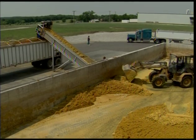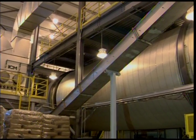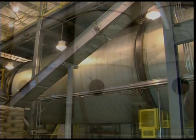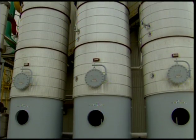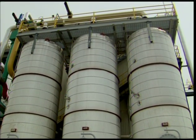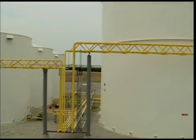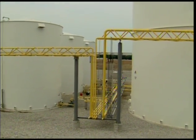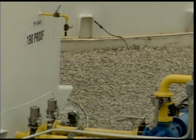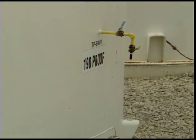The stillage is first routed to a large rotary dryer. This process cuts the water content to approximately 10%. Back at the distillation column, evaporated ethanol moves through two additional distillation columns to complete the distillation process. The process of creating fuel-grade ethanol is nearly complete. When it exits the third distillation column, the ethanol is 190 proof, or 95% ethanol and 5% water.